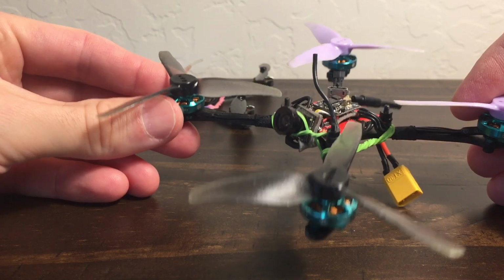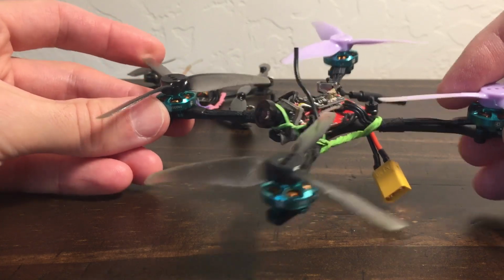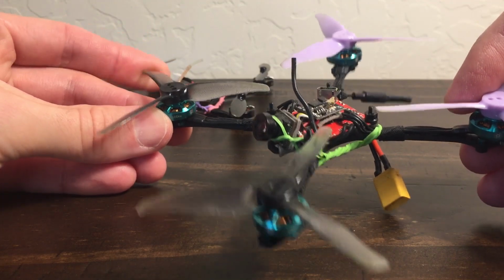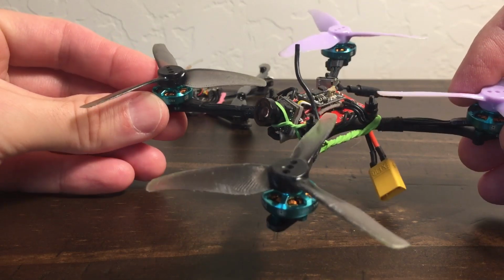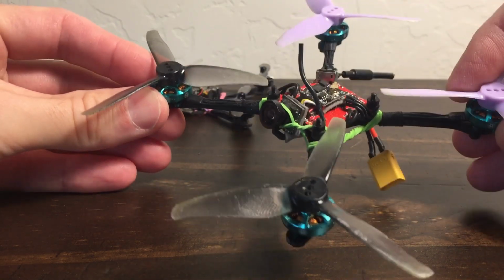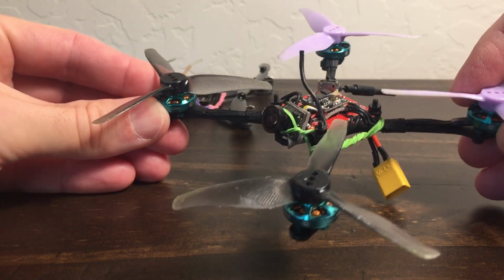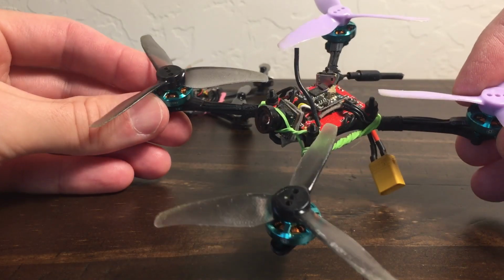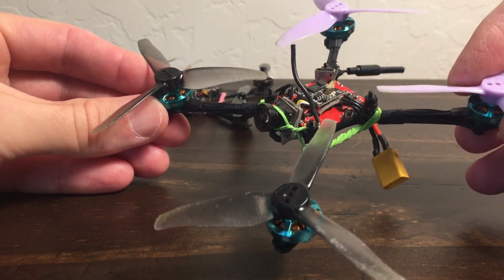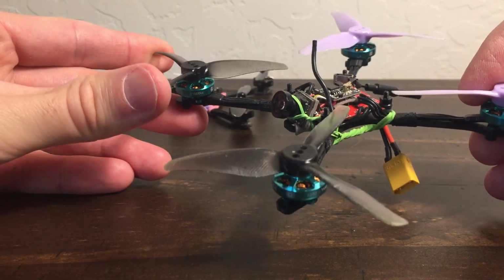I don't know. Maybe it's the battery. Maybe my 450s are the lithium ion high volt versus the 600s being regular LiPo. Maybe that's some of it, but I think I feel a difference. I think I could go flying back to back blind and tell you which one is the 450, and I like it better on this. So I'm kind of stuck in a funny place where I like the way this flies on 24 with a 600 milliamp battery. But on the 450 battery with JESC 48 kilohertz, it's pretty close. I'm thinking if I just stick with the 450 milliamp batteries, I'd do this on 48 kilohertz and then work on the tune a little bit to get it there.